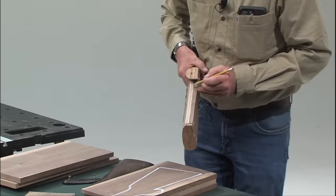I'll also make a line for the contour of the receiver, and then do a guideline down through here using my finger again. The dowels aren't necessary — they're just a design element in this case. We're just using your finger to create that guideline. When it comes down to shaping, we're going to use those guidelines to control our plane, our spokeshave, our chisels, and everything else. We're going to try to leave this part a little high for our carving where we're going to put our pattern.